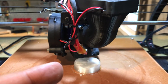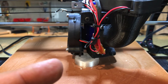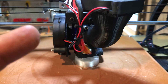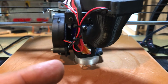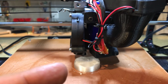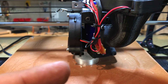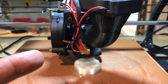Quality and reliability are the goal. When I start a print, I want to hit the button, walk away, and know I'm going to get a part out at the end — because I don't have all day to babysit this, and I don't want to spend half my lifetime cleaning up TPU because TPU is a pain to clean up. With those retraction settings and printing one part at a time at this temperature, it works very well — almost literally error free. I would say probably 99% of my parts print without problems. Those are my tips and tricks.